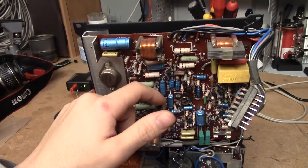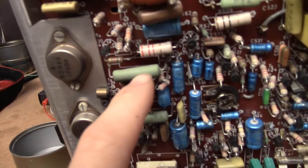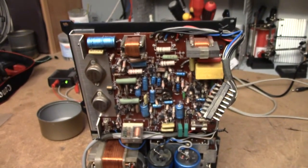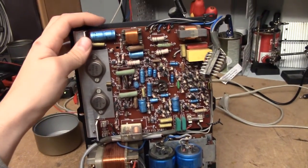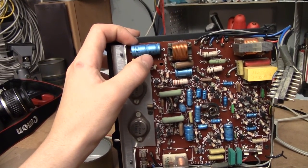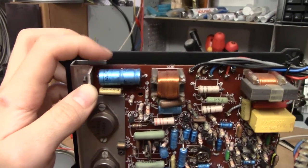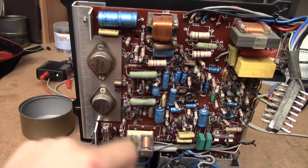I'm suspecting there's going to be quite a lot of iffy-looking solder joints on this thing. It is typical when you have these freestanding resistors all over and heavy components. I'm actually kind of surprised it hasn't failed in 40 years. But I suppose we'll find it has lots of weird value caps, which I'm probably just going to replace with modern standard value equivalents, because a 150µF 63V cap is not going to be used in any signal chain, nor is a 330µF 10V cap for that matter.